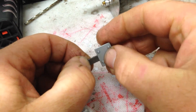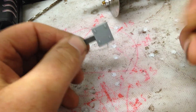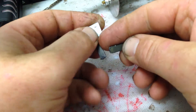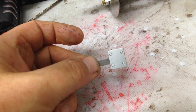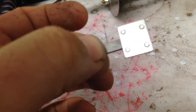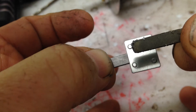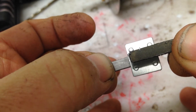What he worked out is there's a neutral zone — like if you put a bit of iron there. So at the moment, that's same poles facing, so we're in repulsion mode. We're still on the same pole facing, and I've got the little bit of silicon steel there. I'll just try to bring this a bit closer so we can see this. So I've got the silicon steel, and when I bring this one over — we're in repulsion mode — it's repelling there, repelling, now it's attracting, now it goes bang.